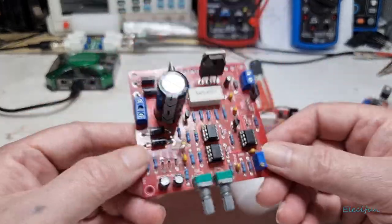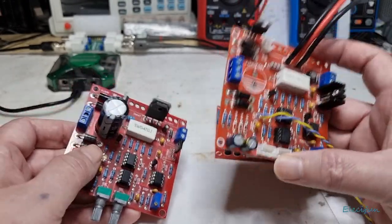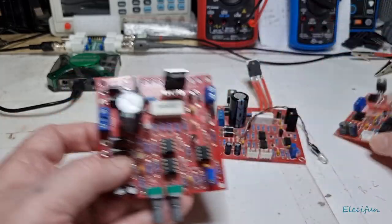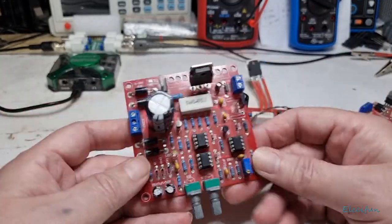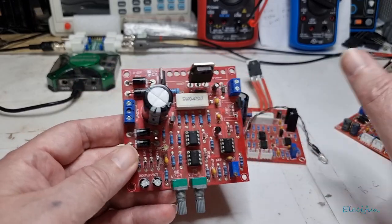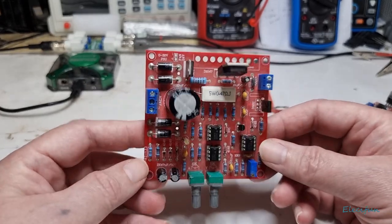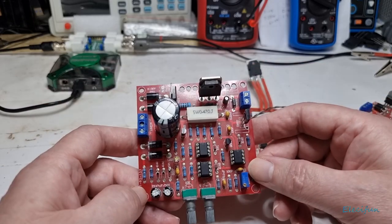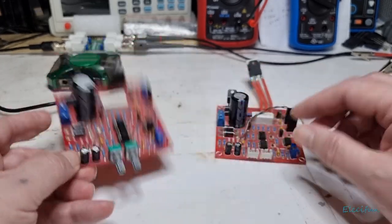If you want to go out and buy one of these, unless you see a video proving you can get 30 volts out of it, you won't. If you're happy with 23 volts out when putting 24 volts AC in — fair play, that's up to you and I have no issue with that. What I do have issue with is when people are trying to tell you that you will get 0 to 30 volts, when you quite clearly can't.